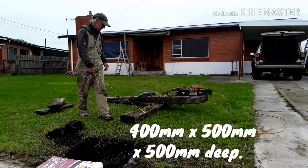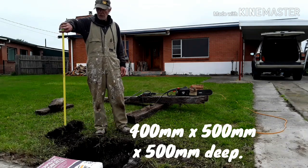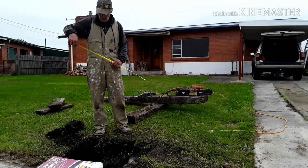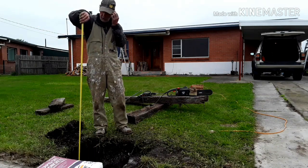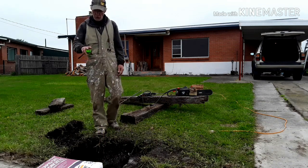I'm going to cut these down. I'm going to have one post that sits up about 1.20m, and the other one's going to be probably another 300mm. So all together I've got 1.7m at the bottom of the hole for the first post, and 2m for the second post — it'll sit at 300mm sticking out further.